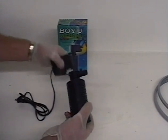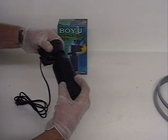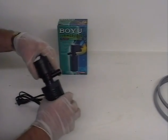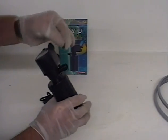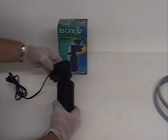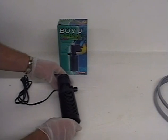This will agitate the part and remove hydrogen bubbles that form during plating. If these bubbles aren't removed, fish eyes or pinholes may form in the plated surface because the plating forms around the bubble. There's a small plastic cap which must be placed over the nipple in the outlet tube.